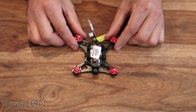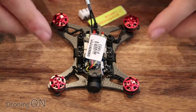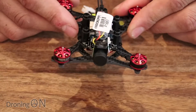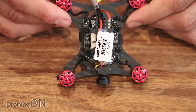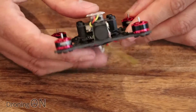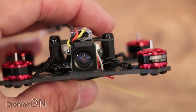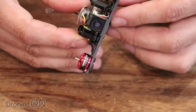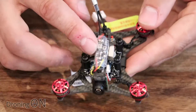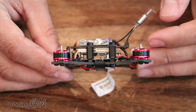Now a look at the GT90 itself. This really is quite a drastic evolution from the previous model. We've got such a strong frame here — that looks like 2mm carbon fibre — so you're really going to struggle to snap this frame. The motors are the same: we've got the 1103 7800KV motors, which are King Kong's own brand brushless. On the front we've got the camera, which looks like the same FOV lens as the original Q90, and we've got the VTX mounted on top. It's just a shame that it's stuck there; without it the quad would have such a low profile.